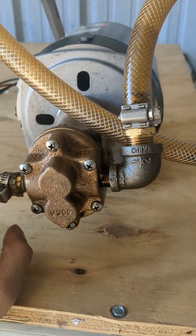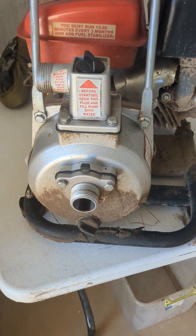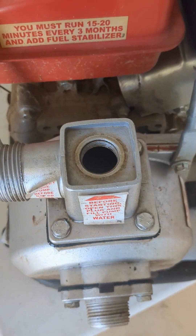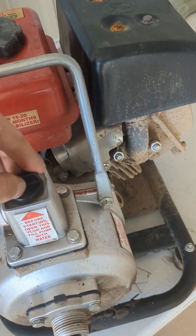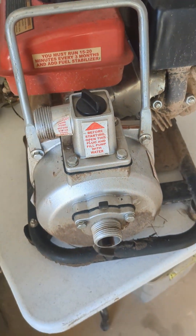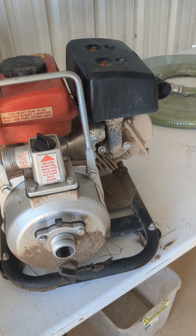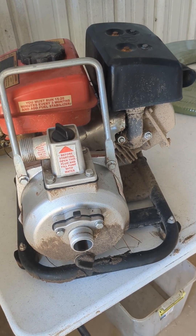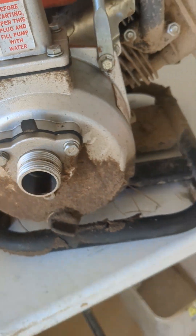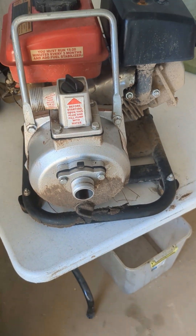This can suck oil pretty good, but the gas rotary pump does not. So with this unit, you're going to have to prime it when you first get it. The best way to do that is by putting oil on the top of this cap right here when you're collecting oil for the first time. You may also need to get a primer — that's something used with trash pumps as a hose primer to suck oil through. This pump came from Harbor Freight. You can get it for about $300. It's a 1-inch coupling — the 1-inch is the cheapest and smallest one, but really that's all you need for transferring oil.